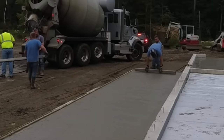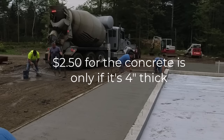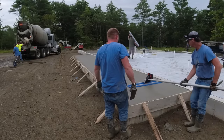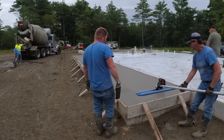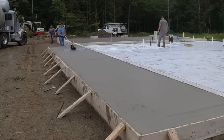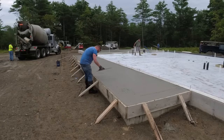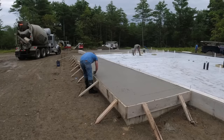For the patios like this, it's again $5 a square foot labor and $2.50 for the concrete. If you want mat rebar in it, I charge extra — it depends on how close together the bars are, and I might price that by the bar or by the square foot depending on how big the area is. A lot of times we'll put number three bar in something like this if they don't want wire mesh. We didn't spec these jobs out — the builder did. You can see him up there laying the styrofoam now. Those guys spec'd everything out and we just showed up to pour and finish.